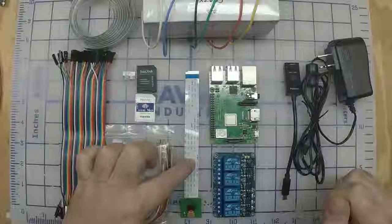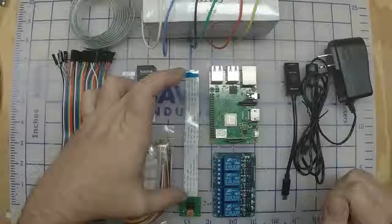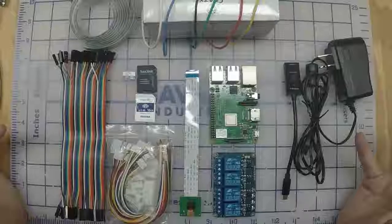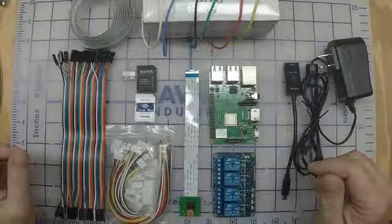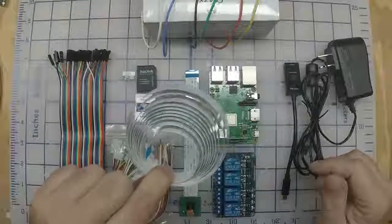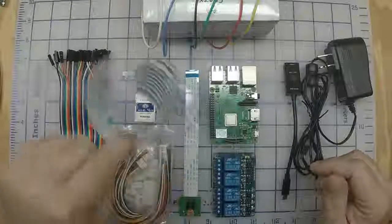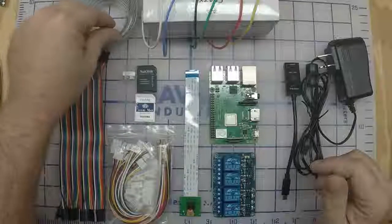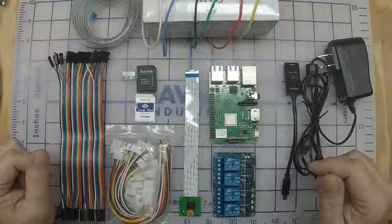The Raspberry Pi camera module comes with quite a short cable. I recommend getting a different cable because I don't think you're going to have all this right next to the camera. I bought this one. It's actually way too long. This one is 6 feet. I'm going to list a 2-foot one in the description. If 2 feet's not enough, you can browse Amazon. They have several lengths that you can pick up.